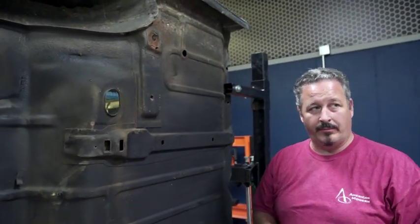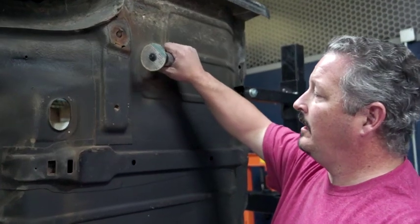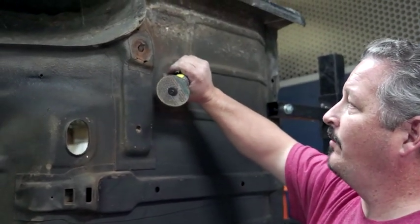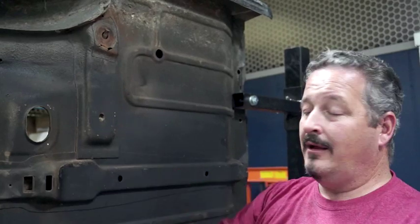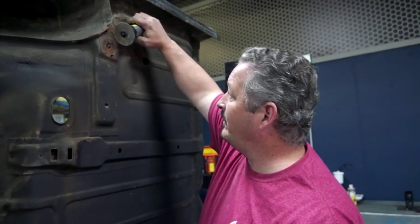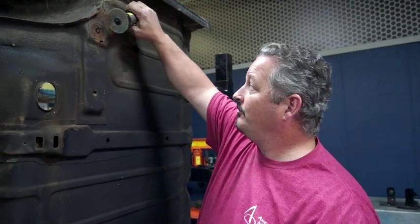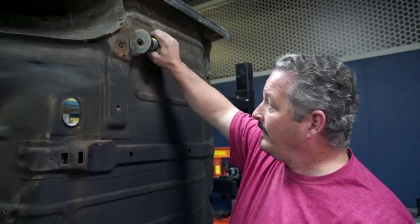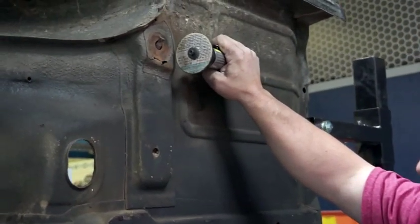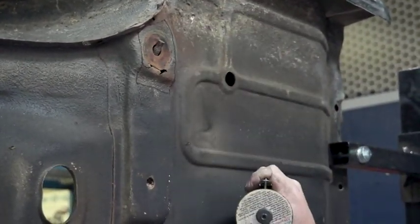There are two ways: you can use a whiz wheel or a plasma cutter. The plasma cutter works well, but you have to have a very steady hand otherwise you're all over the place, and then it's hard to fit it in. I like to do as much as I can with the whiz wheel and then bring the plasma cutter in afterwards if I have to. You've got a straight line here — basically you don't want to go all the way in so it's buried, because then you have no play. Just barely get it through and walk it down, and even if you don't go all the way through, you can always go back and do it again until it's all the way through the metal.